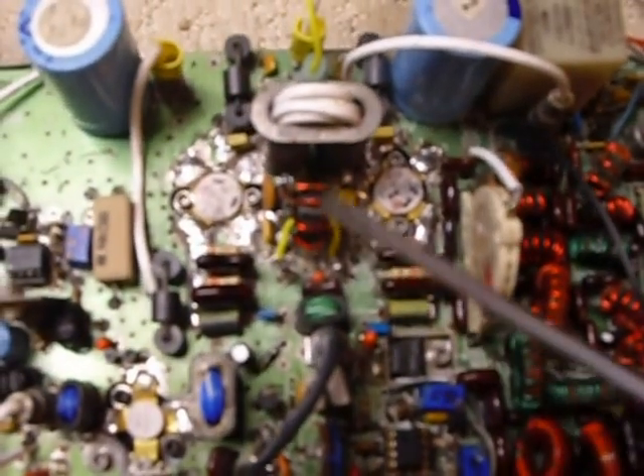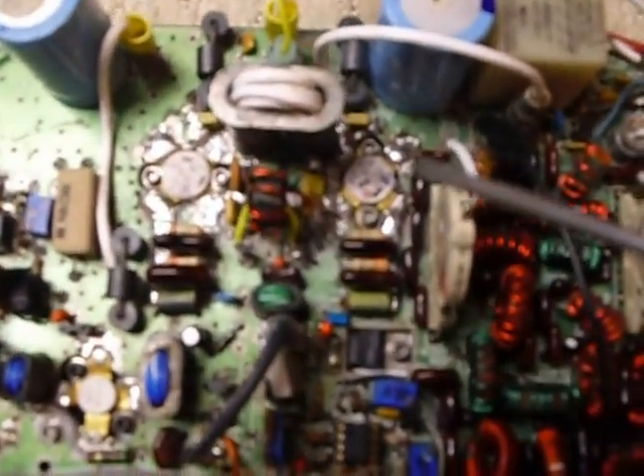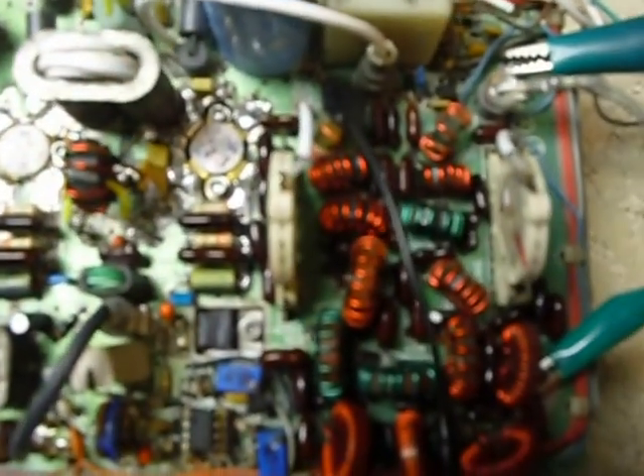The two final transistors were bad in the original. I had picked up about eight pull-out transistors at a hamfest — they looked pretty raggedy, pulled out of some circuit boards. I went through those with an HFE transistor meter and matched up two of them. They seem to be working pretty good; I found two that were good, so that's what I've got.